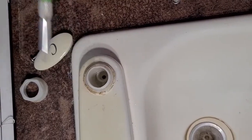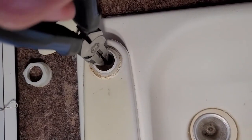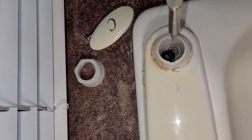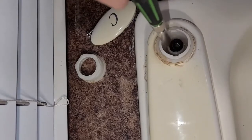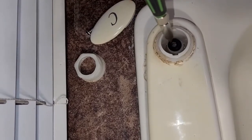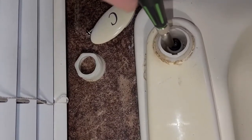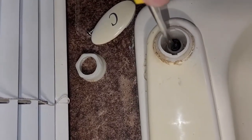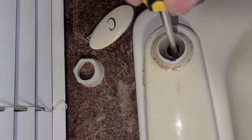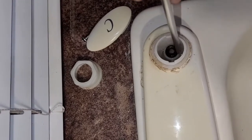To reassemble this, you want to put the spring into that little hole where the cup seal goes with the top of the spring being the small end, and then you want to carefully slip that cup seal into that hole without damaging it. That seal does not need to be scratched or cut while you're putting it in, so you want to gently push it into that hole.